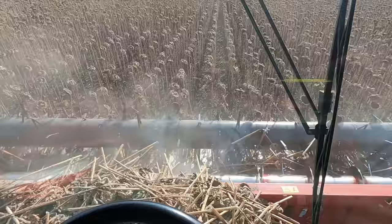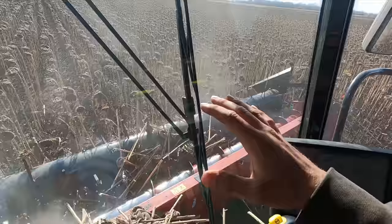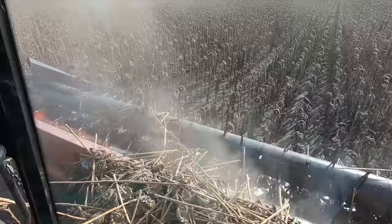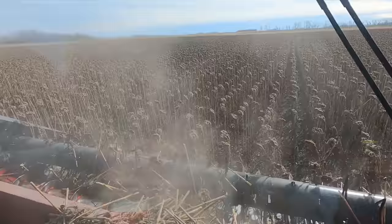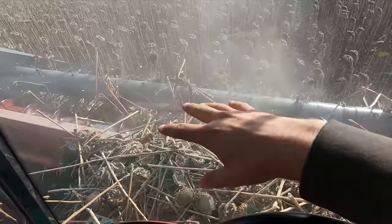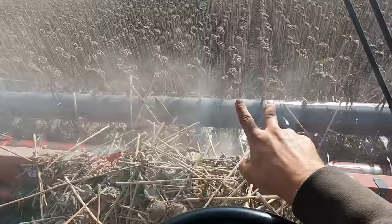You can see it looks like there's a lot of junk in there, but you don't want these sunflower seeds blowing out the back — they're so light, so that's the reasoning behind that. This is a homemade, jimmy-rigged sunflower header and I'm running on GPS — it's a 35-foot header on auto steer. I gotta adjust my height all the time. I've got my drum, that goofy spiky-looking thing spinning there — I got it running pretty slow. I don't want to be losing them off the back, so basically as long as those pans don't plug and are just kind of pulling them through, we're in good shape.